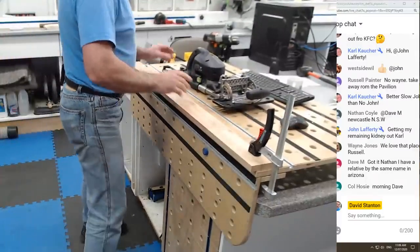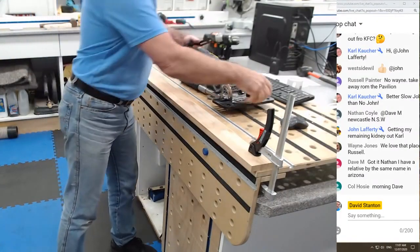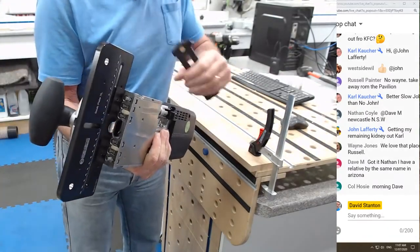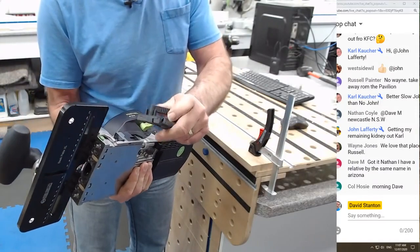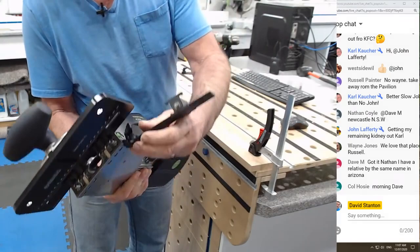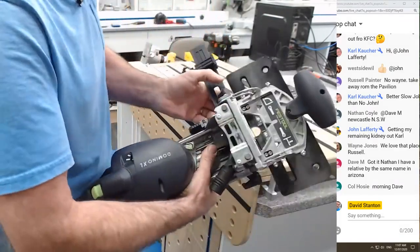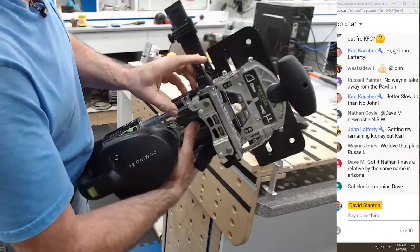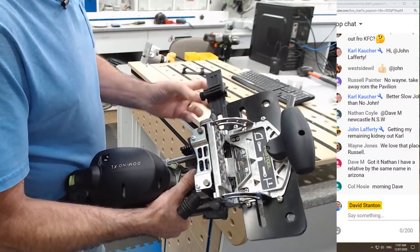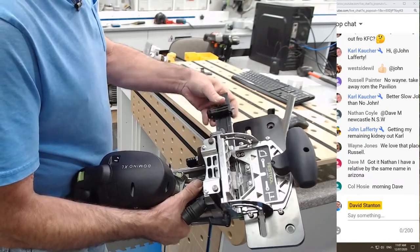All right, so the trim, the cross stops, go into the bottom of the domino, even with the dock plate on. So there we go. There's the area. This is the dovetail section that drops in. Then I can tighten the clamp up on the back, just here, like so. And then I can set this to wherever I want. So I'm going to set it at 200 millimeters.